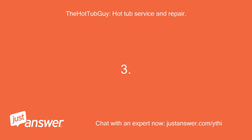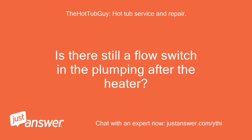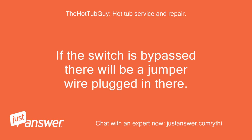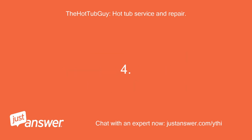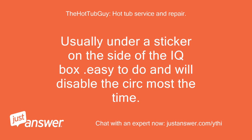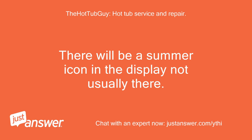3. Is there still a flow switch in the plumbing after the heater? It will plug into the side of the IQ box below the two thermistors in the heater. If the switch is bypassed, there will be a jumper wire plugged in there. 4. Did you flip the summer timer switch by accident? Usually under a sticker on the side of the IQ box. Easy to do and will disable the circ most of the time. There will be a summer icon in the display, not usually there.